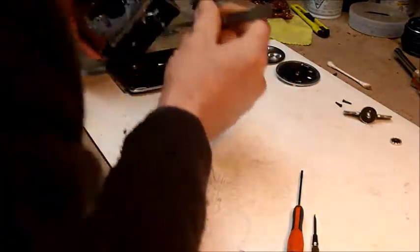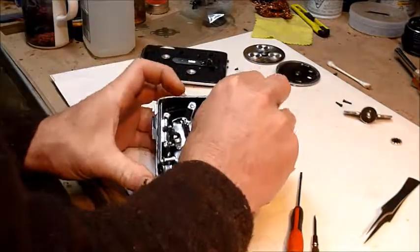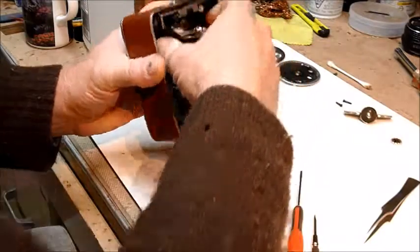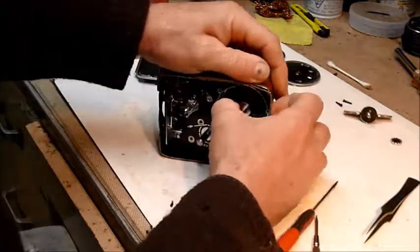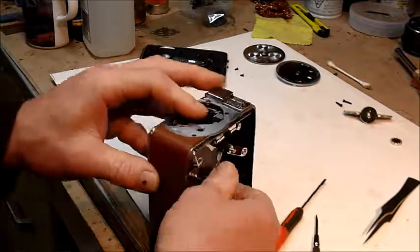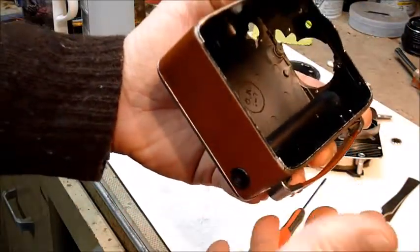Make sure the screws — and just like that it falls out. It's actually not supposed to fall out quite that easy. So let's go through this again: this is also still a working camera. You've taken out those two screws, you've got all the stuff off the front, and you can take — with a slight tilt up this way and a little bit of wiggling — the guts. One thing I did is I made sure that the rotary shutter was in this position, then it came out. Because there are a couple of machined bosses in here that the shutter has to clear.